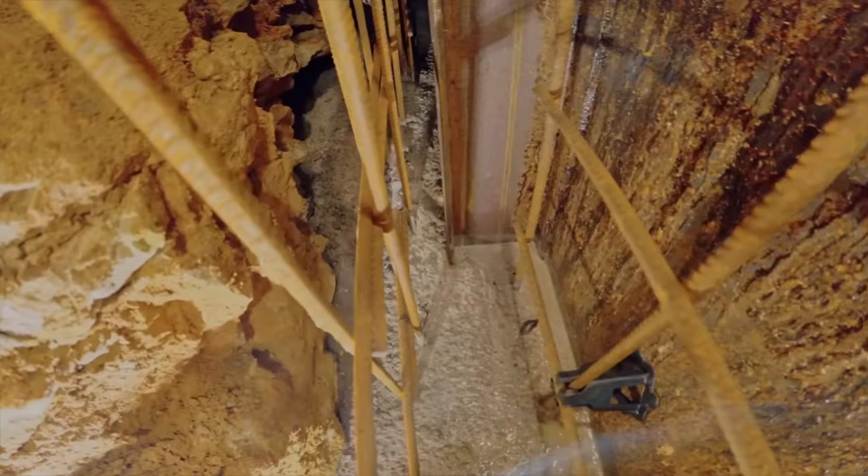What's left to do? First, the concrete from the boundary wall and across the top of the RSJ will be done with a lighter grade concrete — but we're not casting that yet, we'll wait until we've finished the whole room. The next dig can't be as wide as before because we've got the doorway and the house to worry about — if we undermine the door frame and pillar too much we risk destabilizing it. We need to dig up to about the side of the door and straight down, but also a little bit deeper. This is stage two — the next bit of room to form — and it'll be a lot easier because all the 400mm bars are sticking out ready to build off.